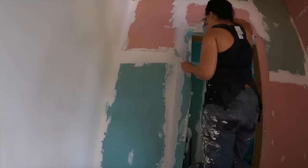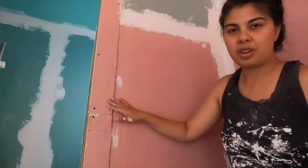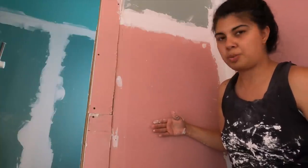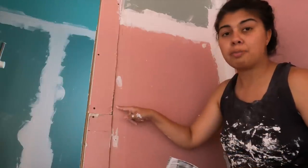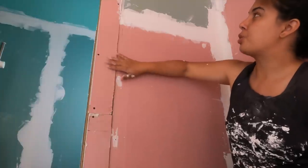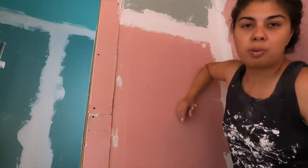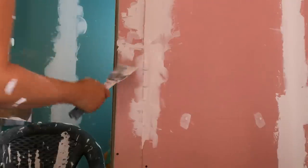Okay, we have the classic tapered edge and cut edge over here. So what we're gonna do is try to straighten as much as possible. And the way you do that is you basically add more of your compound, the tape bit, than I've been doing before. You basically pack it up. It would have been better to have had that piece here and then put a whole piece. But you know, we do things the more complicated way because it's more fun. Okay, so I'm gonna work on that now.